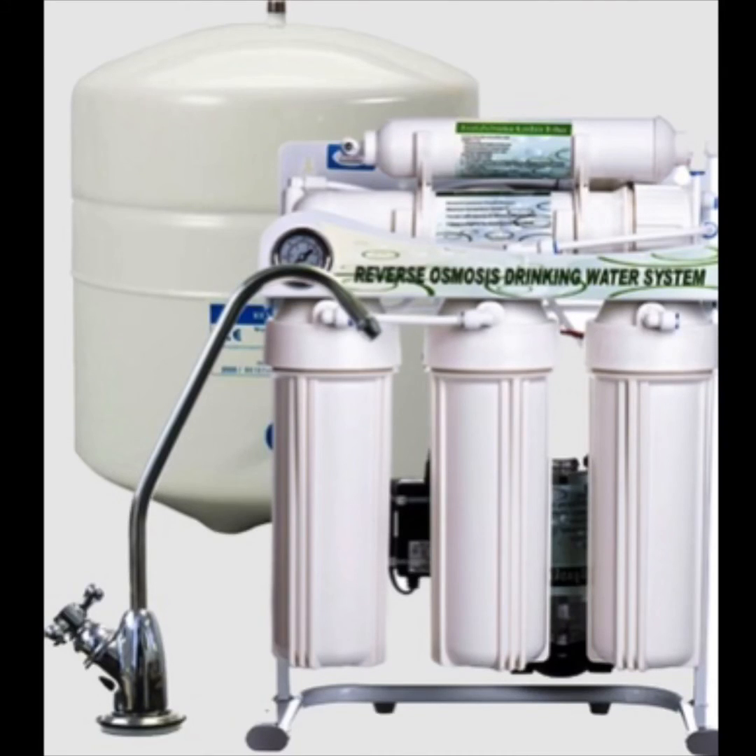So you've got your tank filled up with air. Go ahead and put it back under the sink and attach the line from the tank back to the system. You can go ahead and open up the valve on the tank and the water line coming from the cold water copper pipe and you're ready to go. The tank will start filling up with water and you're in.